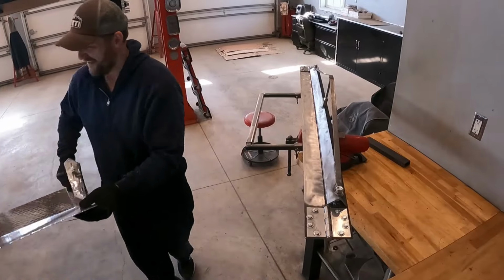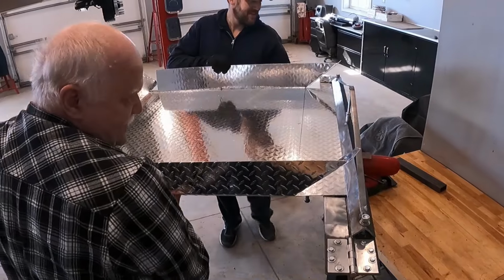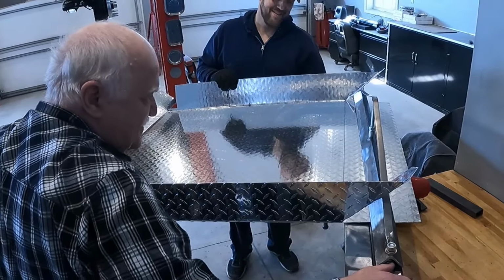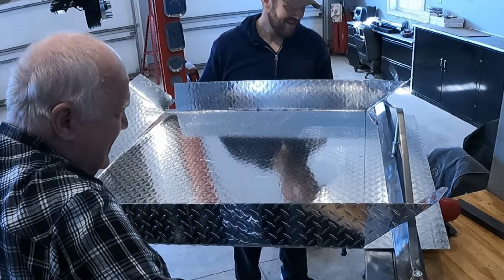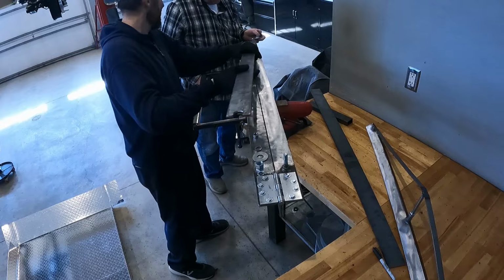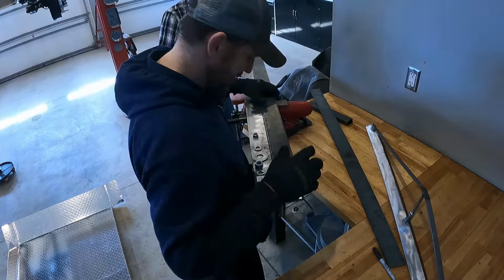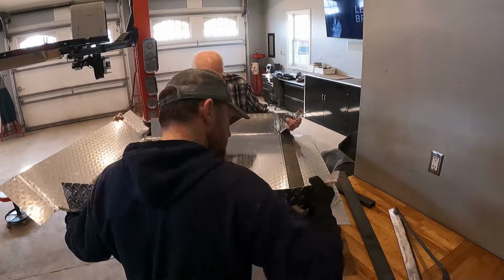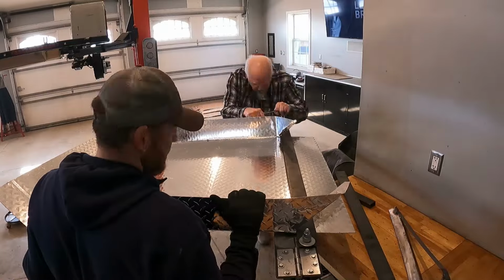And then I ran into some problems on my last bend. The DIY brake doesn't allow it to fit in there once the other sides are folded up. Son of a gun. So we ended up improvising with the two of us. We decided just to put a piece of flat stock instead of the top clamp that's positioned on the DIY brake. We also had to cut the skid plate just about 3-4 inches on each side where the sharp angles are. That allowed us to bend them in by hand. And then later when it was folded, we were able to straighten them out by hand also.